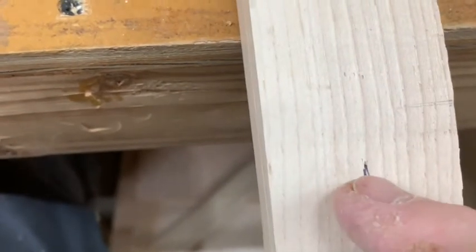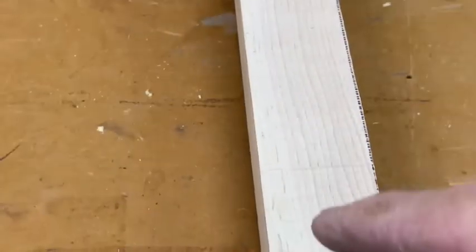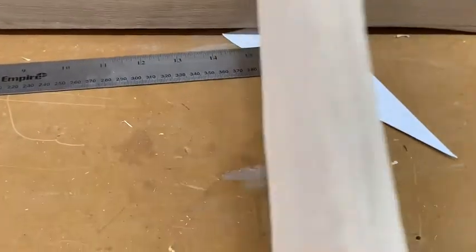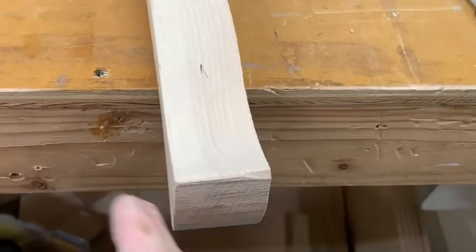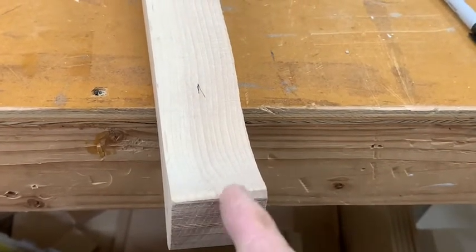We'll pull off 9/16 to the right and 9/16 to the left, make a mark. Same thing down there, connect the lines, and we'll get to connecting the lines here in a minute. Connect the lines and then do the same thing on the bottom with your calipers. And then what you end up having is, if this isn't square, you still have a center line that's cutting through. It's perfectly vertical.